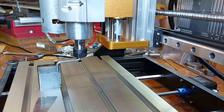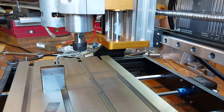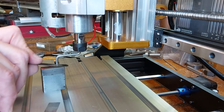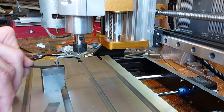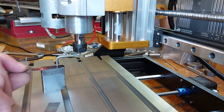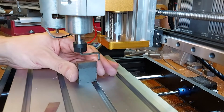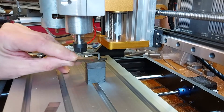I'll set this at the right height — take it up a few millimeters, then come down slightly in 0.1mm steps. You can see that gap closing. It's quite useful to just hold a feeler gauge onto this because you can see the gap close very rapidly. We're pretty close. I've got a feeler gauge that's just got a little bit of tension on it. If I swing that arm to the back, I'm now measuring effectively over two points — these heights should be exactly the same.